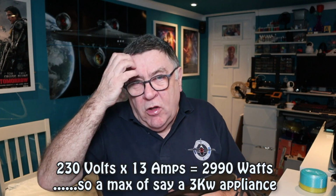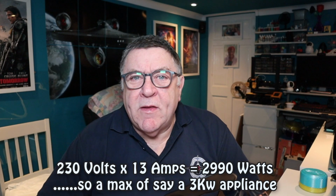It's really nice. A blue backlit display gives you kilowatt hours, peak usage, minimum usage, and so on. So that's handy if you can get at the plug like I did here, and I could film it. But obviously with your washing machine, there's no way you can just keep plugging this in and out to do videos, a big bulky washing machine, whereas the little Tapo energy analyzing plugs just stay in there all the time. They can take up to 13 amp load, so you can work that out, say 2 to 2.5 kilowatt, I would say, safe load.